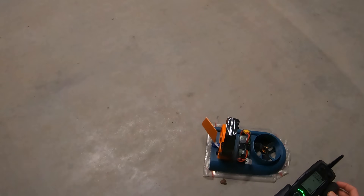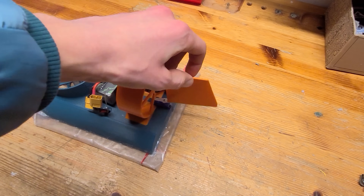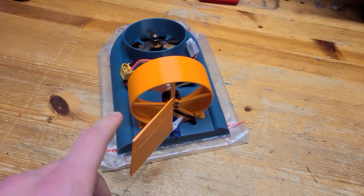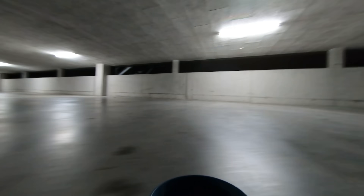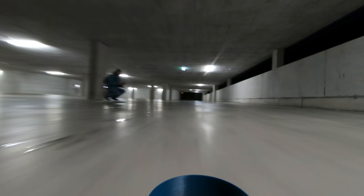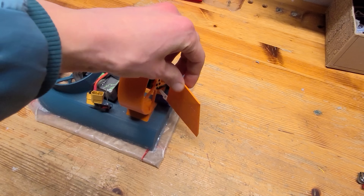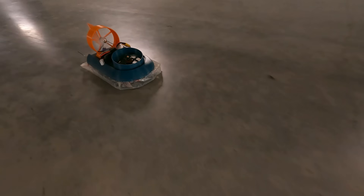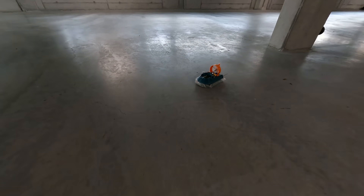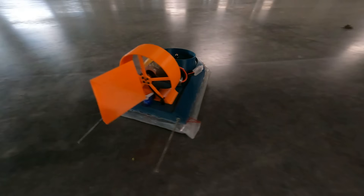I killed the servo. My hovercraft still wasn't working too great in these clips — the weight balance was just too far back, making the back end oscillate. In addition, the steering rudder and servo had zero protection, making them very prone to damage in crashes. But that all changed when I removed the onboard camera to shift the weight balance forward and added M3 threaded rods in the back to protect the rudder and servo from impacts. By doing that, my hovercraft got really awesome. Just watch!